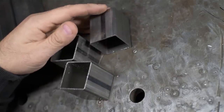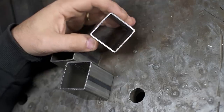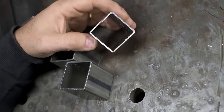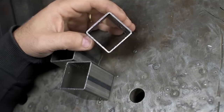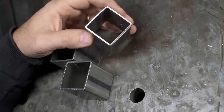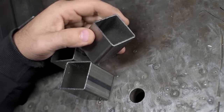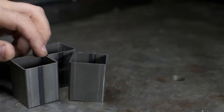Before getting into building the cart, I thought it might be helpful to use some short pieces to tune in the weld settings. This is thin wall - 60 thou - and I'd probably set my machine to about 70 amps or so, though it's not super important since I use a foot pedal for amperage control. This stuff should really only need about 60 to 70 amps tops, depending on the joint type, filler wire, and how big a bead you'd like to lay down.